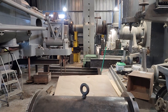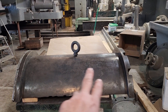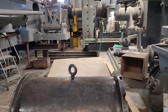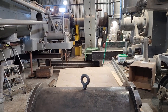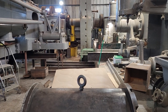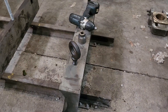Another reason is we don't know for sure how perfectly level these were installed from side to side. The bearing may not be touching the shaft exactly right all around. It's impossible in this situation to do the old-school method of putting bluing on and setting the shaft in to see the high spots — it's hard to do that when the thing is 130 tons. So we're going to repour them with the shaft in place and then we'll know for sure we're getting a good bearing.